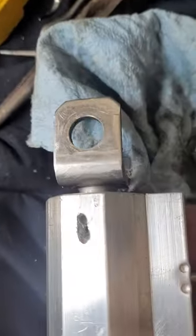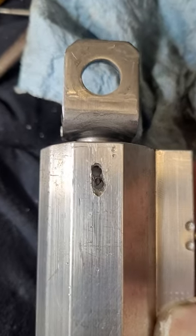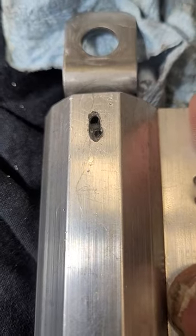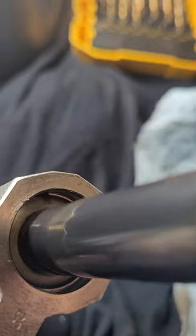The point is you're going to have to drill a hole. These are basically made to be non-serviceable, but if you drill the hole at an angle you can get in there and push the retaining ring out. You can see down in there there's a retaining ring right there, and there's no way to get it out unless you drill this hole.